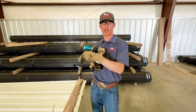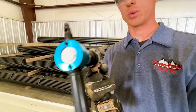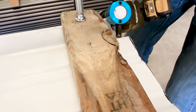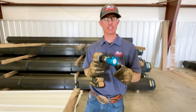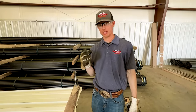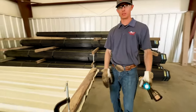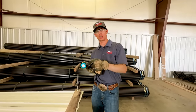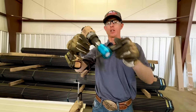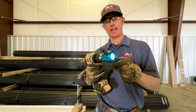We've got this little handy tool now — it literally just hooks onto your drill, just like the last one, and just chips away at the metal. Let's see how well this works on this PBR panel. That is a pretty cool tool. It did take a little bit longer — about 1 minute 40 seconds. It literally chips out little fingernail-sized pieces of metal all the way across. The dips and valleys on the PBR panel were a little more difficult. If you had a straighter, smoother piece of sheeting, this would work fantastic — especially if you're doing circles or different curves. Pretty cool tool.